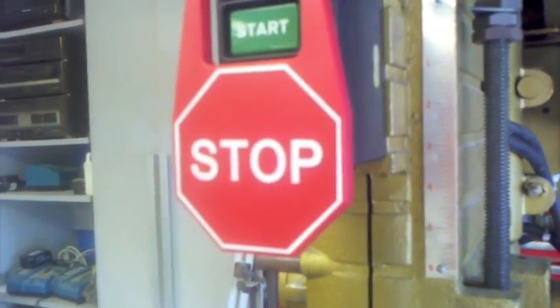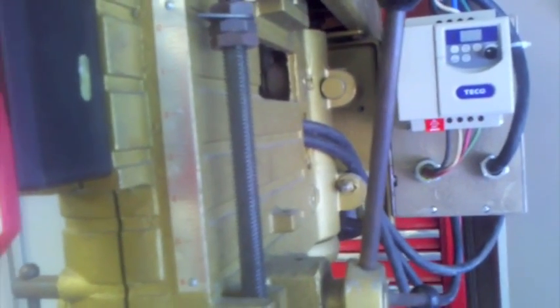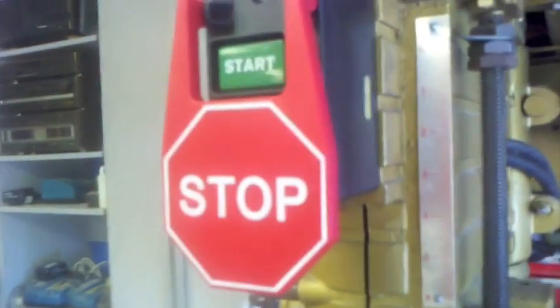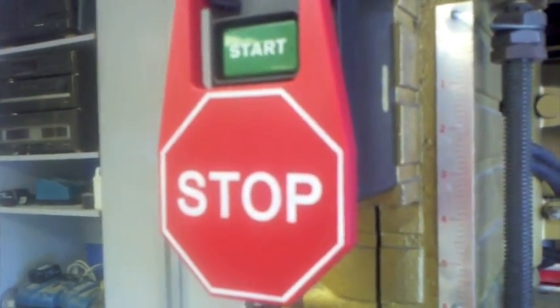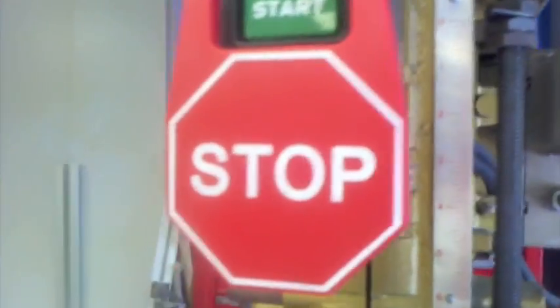I can actually run, start, and stop the VFD from this switch. I think when the manual talks about running unswitched, they must mean avoiding an electronic starter on a three-phase setup. The Rockler switch normally runs about $39 — I think it was on sale plus a 20% off coupon, so I ended up around $26 or $27 out the door. I thought it was pretty nice to have this big paddle on the front. Worst case, I could knock it with my forehead if things went awry. You can see two wires running in — one from the power supply into the switch, back out to the VFD, and another coming in from the motor.